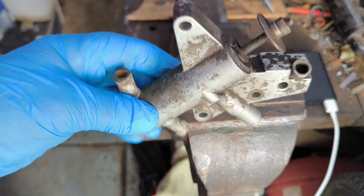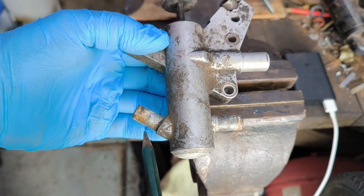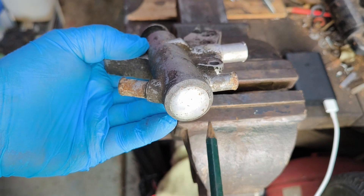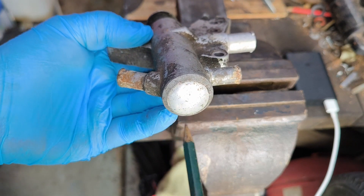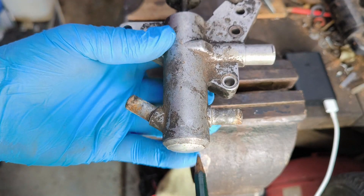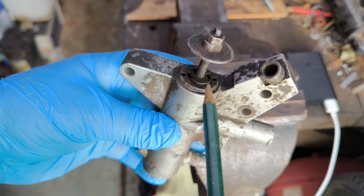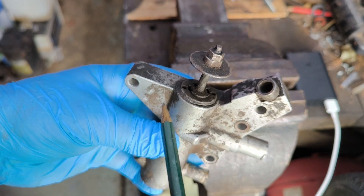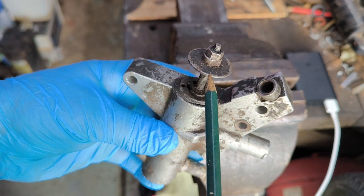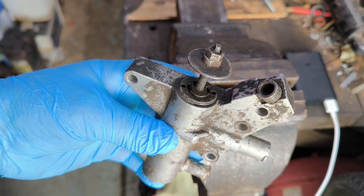So here's a warm-up unit as we move from the car. This is where the water flows at the bottom — check the condition of this, it should not be corroded. If it is, you might be able to fix it with some epoxy or something. And this is the cone and the collar, and this is the top hat washer. First we're going to remove the top hat washer and then we're going to remove the collar.